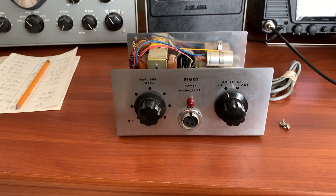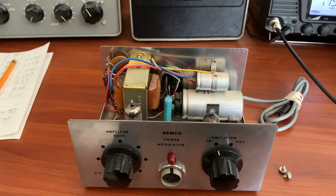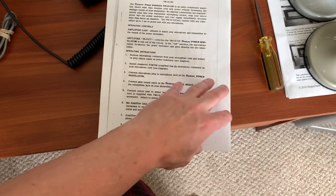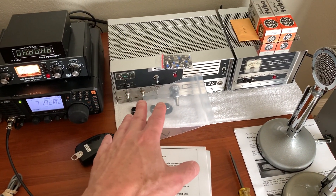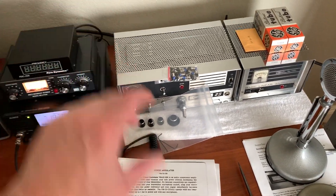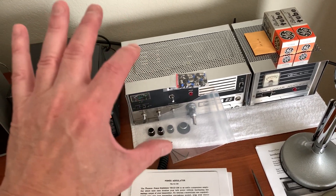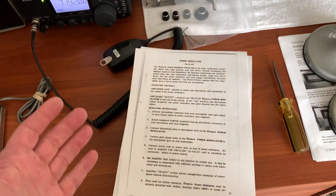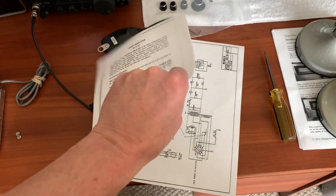It makes it look really pretty though. Anyway, the name is kind of deceiving — it's not really a modulator and it does nothing to increase your power. I found the manual online and it says it's supposed to double your output power, but that's BS — it was a marketing gimmick. What it can do is if you hook it up to a radio that has trouble getting the full modulated envelope, it'll make the envelope full, which could maybe increase your peak-to-peak envelope power just a tiny bit. But it's not going to double your output power — they knew CB operators back in the day didn't know any better.